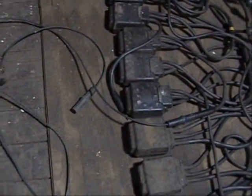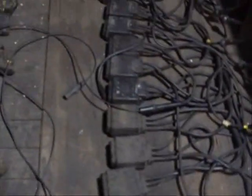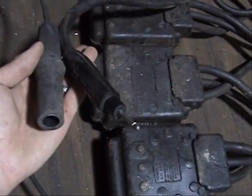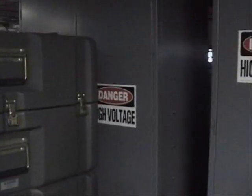Now we need two separate loads. One load for one of the regulators — we're going to use our lamp load here, which is about 10 kVA worth of lamps, all on isolation transformers in a series circuit. This load has one female end and one male end. The other load we will be using is our load bank, which is a series of power resistors that we can tap at different points. We have it set up for 10 kVA, so we have one male coming out of the 10 kVA end, and on the other end we are hooked up to our common point, which also has a male connection.